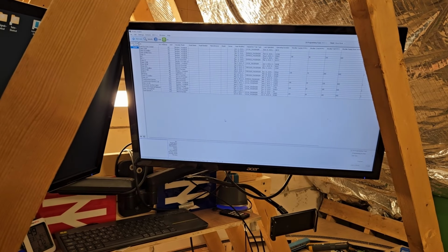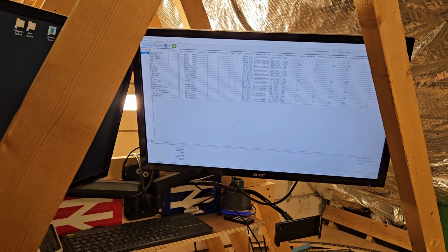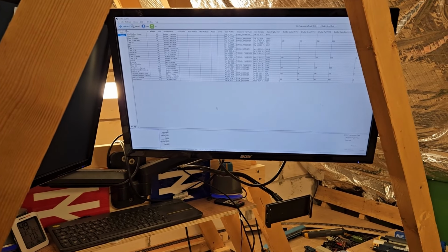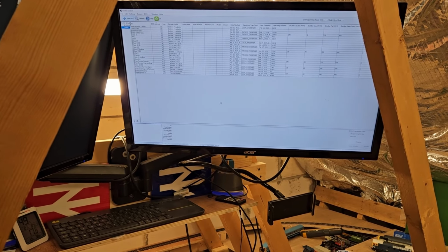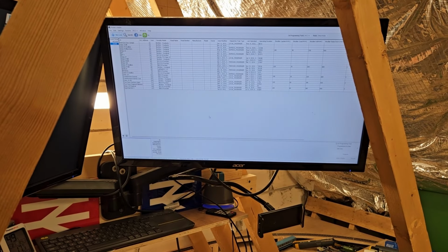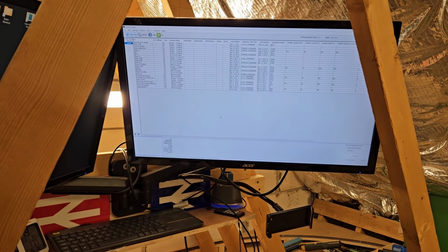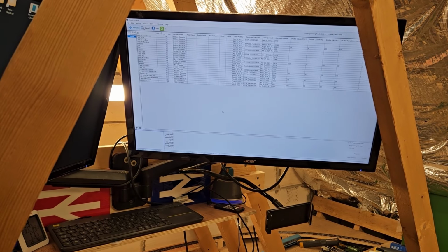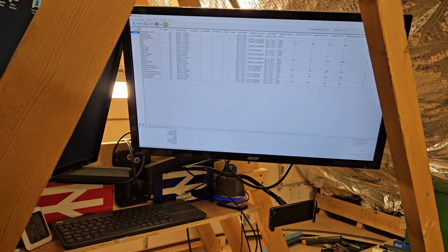Now I am going to get on to the purpose of this video in a minute, which is going through the basics of getting a CSB1 connected up to a computer, getting JMRI installed on that computer, and using the real basic non-automation related functionality of JMRI, which is DecoderPro. DecoderPro just focuses on giving you throttles for your trains and a really intuitive user interface for programming CVs, whereby you don't need to ever think about CV numbers or values, anything like that. You just get a little Windows interface and you click boxes and you program your trains that way.